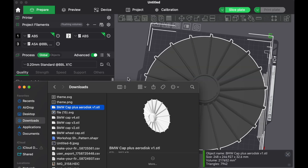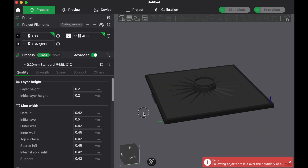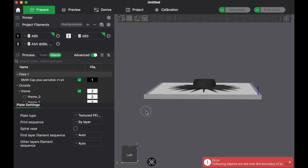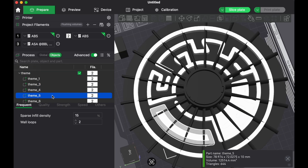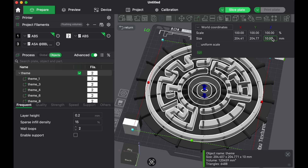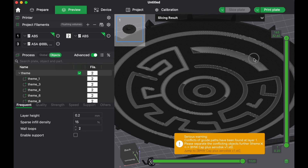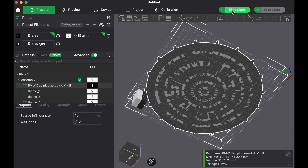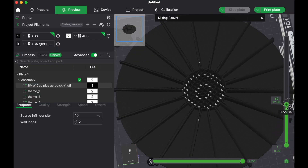Once you have the files exported from Shapr3D and ChatGPT, you can drag them into your 3D printing software like Bambu Studio. Just make sure you select your objects and center them up. Now we can start selecting the different ABS filament colors assigned to parts of the SVG image — we're going with black for the AeroDisc object and white for the image. There are some extra parts in the SVG we need to delete by selecting and removing them. The height of the SVG object needs to be shorter than the actual AeroDisc, and one millimeter seems to do the trick. Once you slice the part, you can see what it's going to look like — but it doesn't look quite right without one extra step: select the two main objects and select merge. Now slice the plate again and take a look at the difference. The first layer for both colors looks way better. I also like to check each layer to make sure everything looks good.